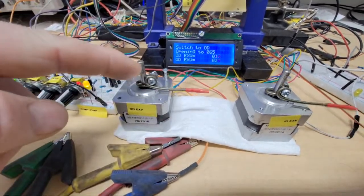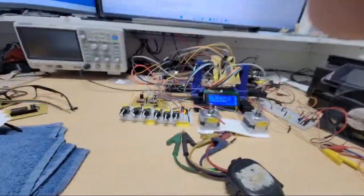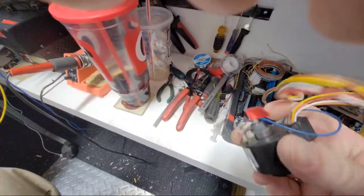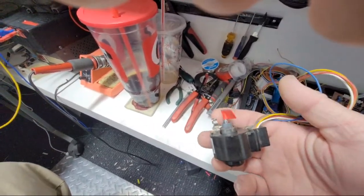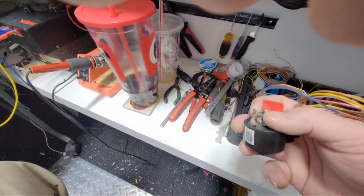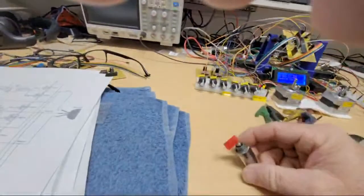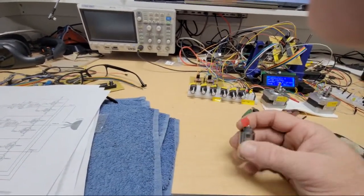I was just going to put this outdoor one right where the indoor one was. And of course, that's just representing one of these. This is an electronic expansion valve cutaway. I had to take the coil windings I had and use it on the unit when I moved it outside, so this winding ain't working right. But this is still that cutaway I was using when I had hooked up before, and you could see the needle, which I just put a piece of tape on.